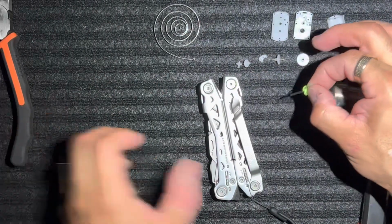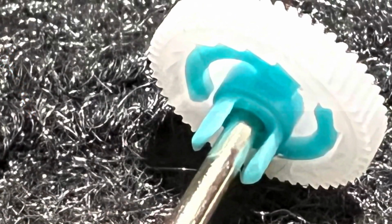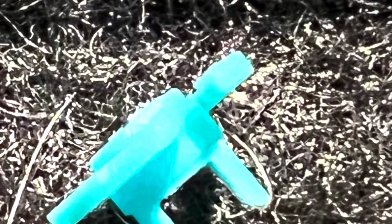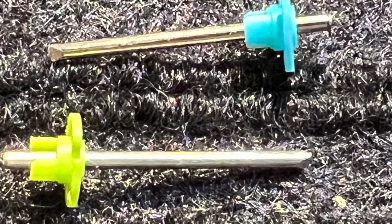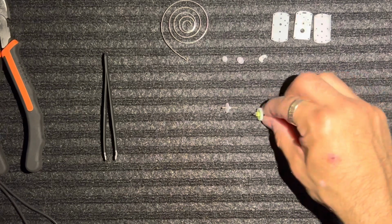So to recap, to be able to extract the S-spring gear from its axle, you must place the flat end of the S-spring gear and not its ears upon a hard surface in order to extract it. And when you flip it, as shown in the photo here, the one on the bottom winds counterclockwise, the one on top is clockwise. That would be the difference between them after you've completed the modifications to them.